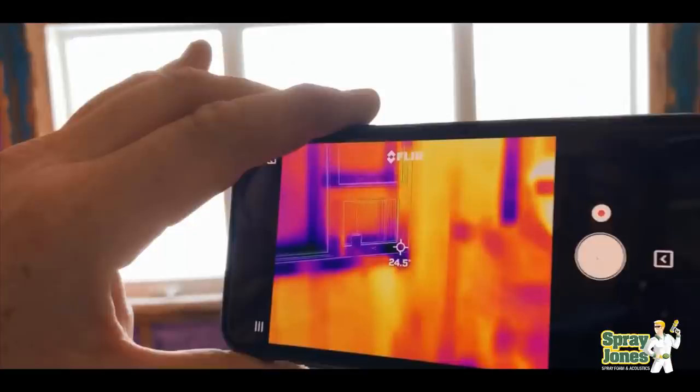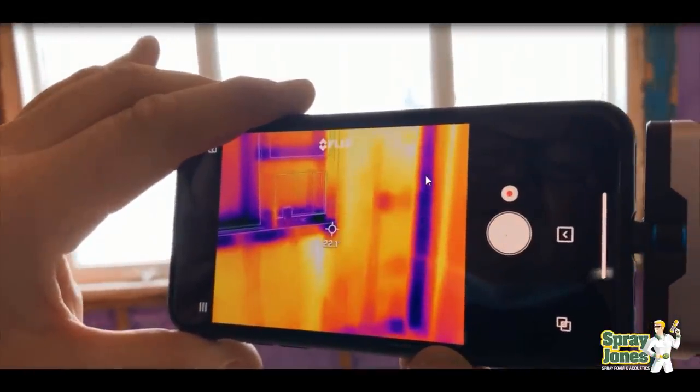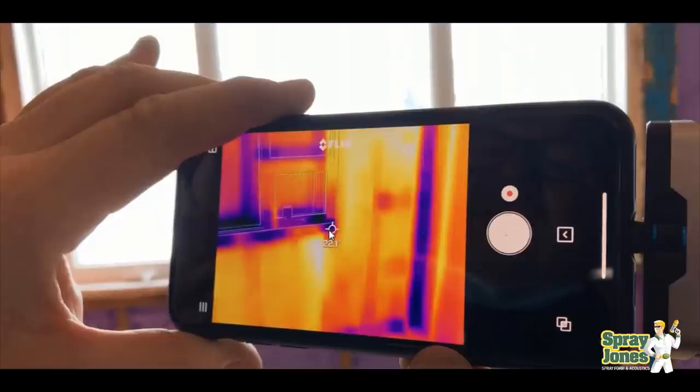Two inches of closed cell foam is the exact spec written for this project. They came to me and asked what I'd do on a 2x4 wall — I said two inches of closed cell foam. They reviewed the same data you're reviewing right now and made the same decision. You can hardly see the 2x4 studs in the thermal image. If they were such good conductors of heat, transmitting heat to the outside, we'd be seeing much cooler temperatures. Over here we have the far corner and the window — around the window they retrofitted with extra blocking that hasn't been fully caulked yet, so you can see cold air leakage showing only at 22 degrees at that corner.